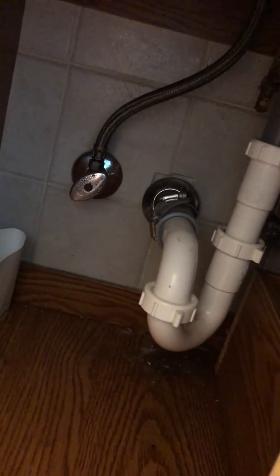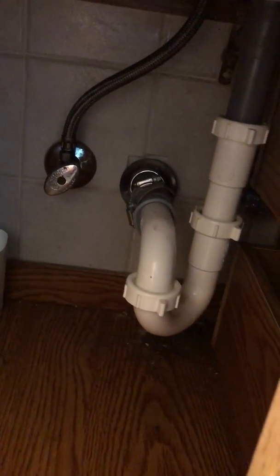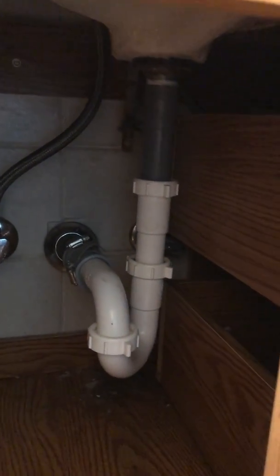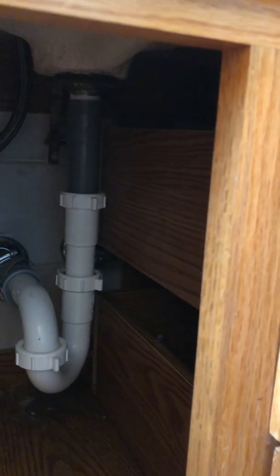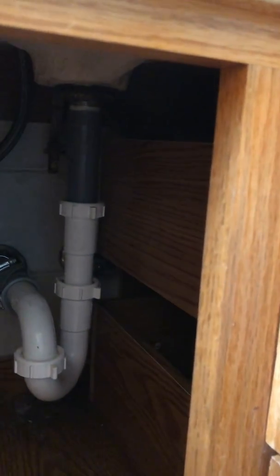I recommend the air conditioning not be turned off because it can grow some microbial growth. You can have some microbial growth in the home, so you want to leave the air on. The gas will not leave your air, but the home will have some growth issues, especially in humid South Florida, where we're located.